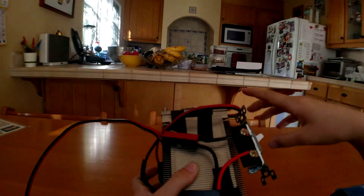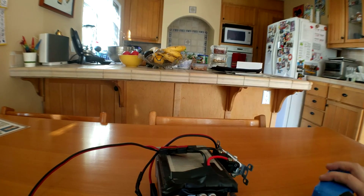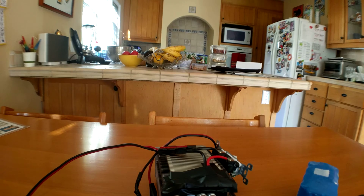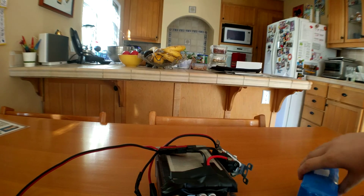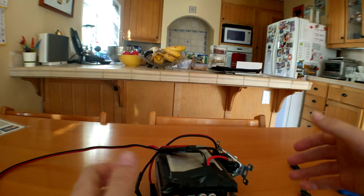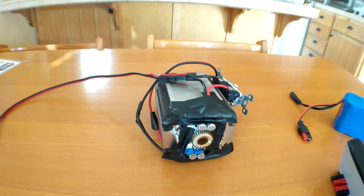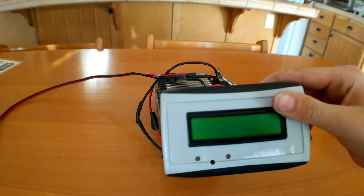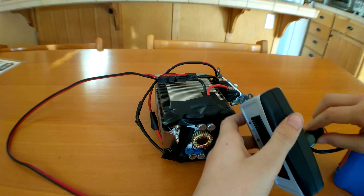It's pretty darn crazy how bright this thing is. So that's just something I made today — this flashlight, this afternoon. It's about 9,000 lumens. It takes around 8.95 amps, or basically 9 amps, at 12 volts — so 9 amps, 12 volts, and about 110 watts, what this meter said. I forgot to show on camera what this meter said, so I'll go do that again.